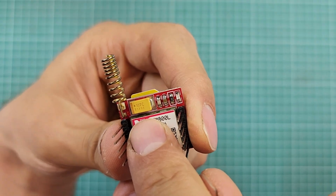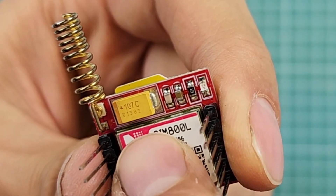After considering voltage and current, if the problem is resolved, that's good news and you can skip the rest of this video. But if the problem persists, or if the problem is partially resolved and still sometimes resets, consider adding a capacitor near the VCC and ground pins. There is a tantalum capacitor on the module — that yellow colored component — but you can add more capacitors near the module to stabilize it further.